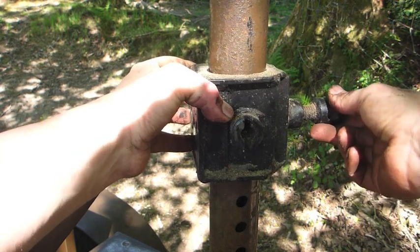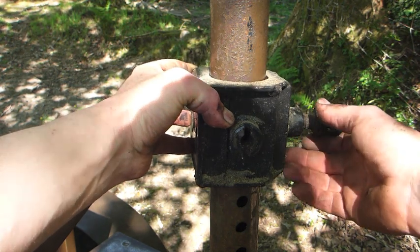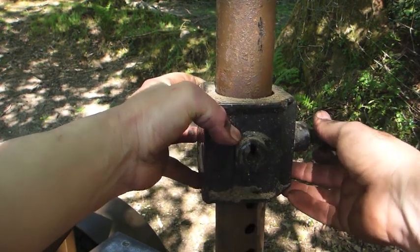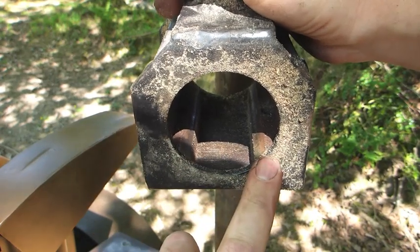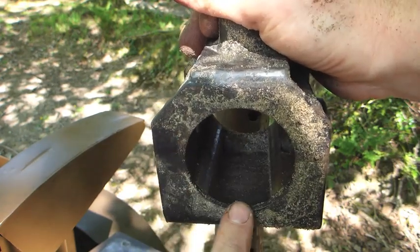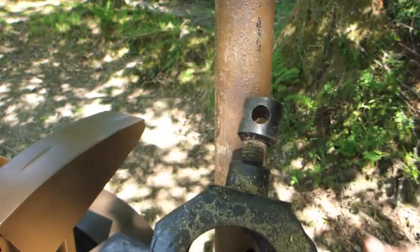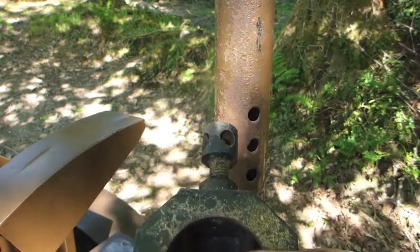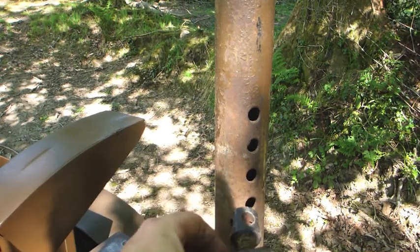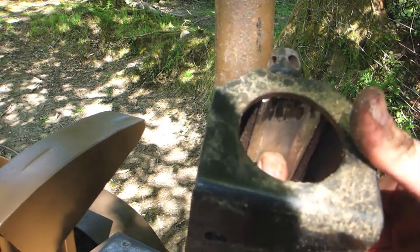But they used to wobble around an awful lot and were far shy of what the manufacturer called 'rock steady.' Two round things one inside the other — it's got a lot of squirm and wiggle room. You can see I've welded in two fixed points so that the leg now rests between those and not on the bottom of the hole, so it's really resting in a gutter. On the front I've put a locking screw, and a load pad which shares the load and means the screw doesn't start eating holes into the leg.